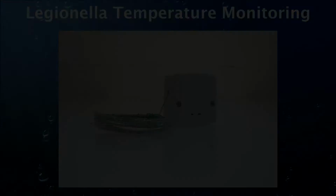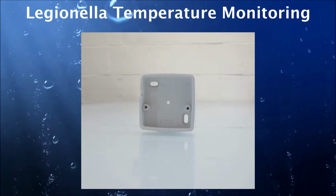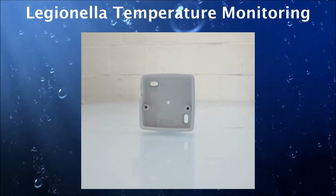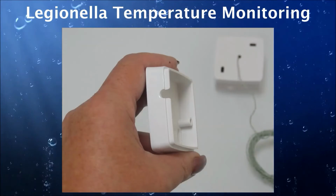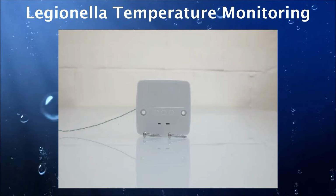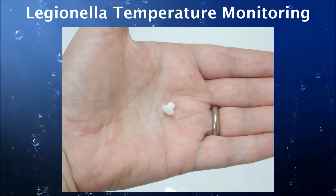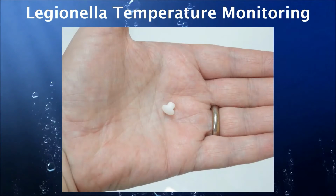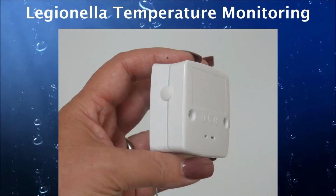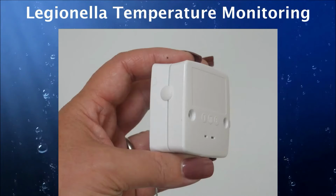Now only a few more things left to do, the first being mounting the rear plate. It's important at this stage for both placement options that when you're mounting the rear plate, this little dip is on the left in order for the front plate to fit properly. If your placement option was the central hole, you can now screw the front plate in place, and this is where the little cap comes into play. If you choose to, simply push this into the side hole. Popping this in just lessens dust ingress and makes it look a bit neater.